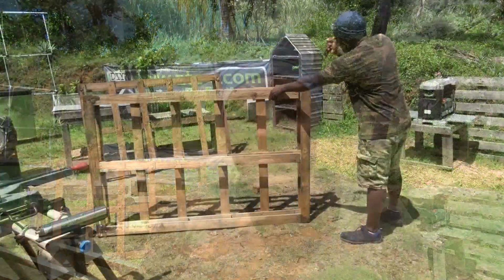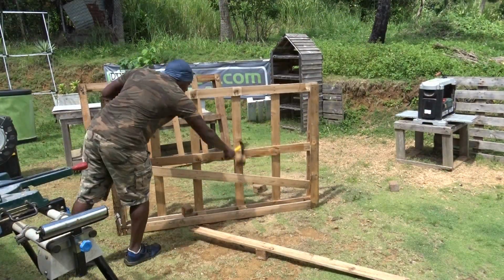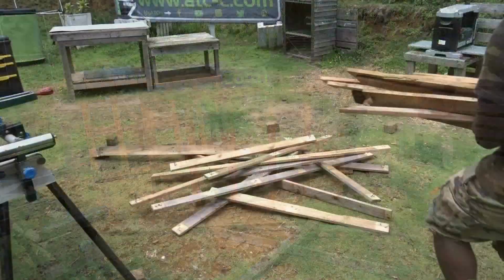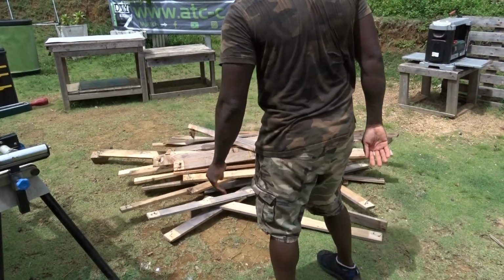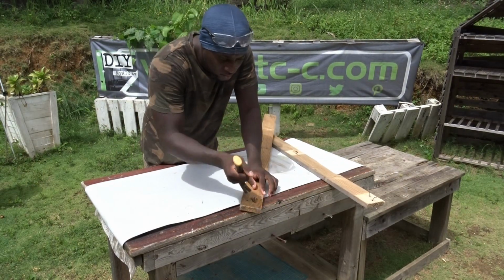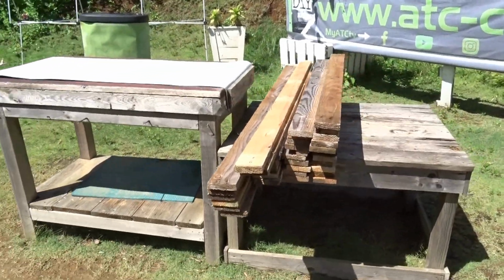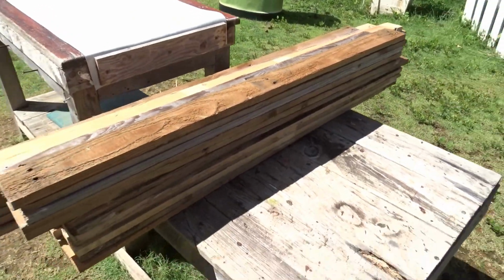Alright, let's move on. As I was telling you, you can either use your hammer or your reciprocating saw, as I'm doing it here. But as you can see, I'm mostly using my hammer. Then I'm able to collect all those pallet wooden slats. After that, I'm removing the different nails, again using my hammer, but this time the small one, to have at the end this result with a lot of pallet slats that I will be using in order to create the pallet table.